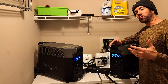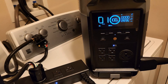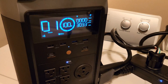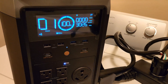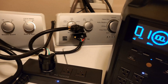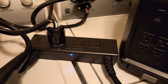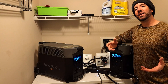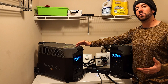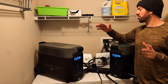You can see the consumption rate start to go down here on the interface — we're really going to have about an hour's worth of time to run this dryer. Each of these units can put out up to 3,600 watts, so it's very interesting that you can get a solar power generator that will easily power large appliances like a dryer. A lot of people have asked me about EcoFlow products — will this power my refrigerator, my chest freezer, my dryer — and I can tell you that the Delta Pro size units can easily do that, especially once you get the double voltage hub which allows access to the 240 volt range.